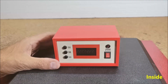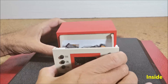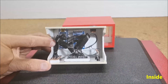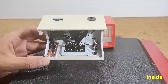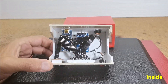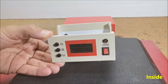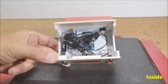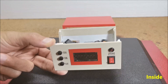The device is very simple to make and consists of several components: an Arduino Nano microcontroller, two HPDL1414 LED displays, and a DS3231 real-time clock module. Three buttons are not connected to the circuit at the moment; in future versions of the code they are intended to be used for setting the time and possibly an alarm.